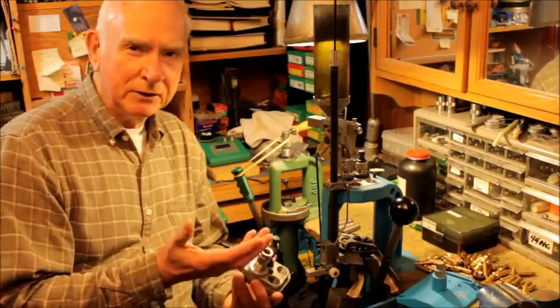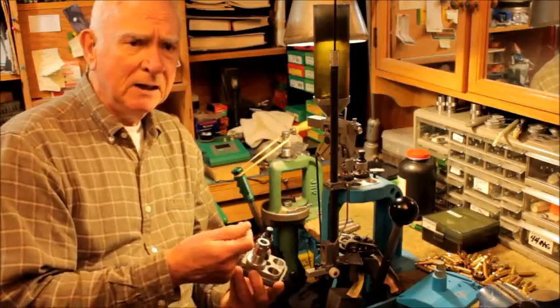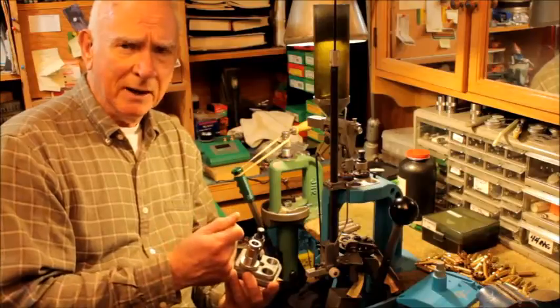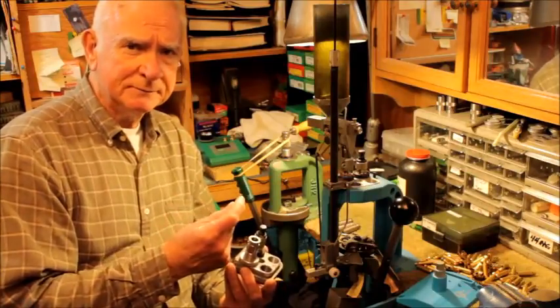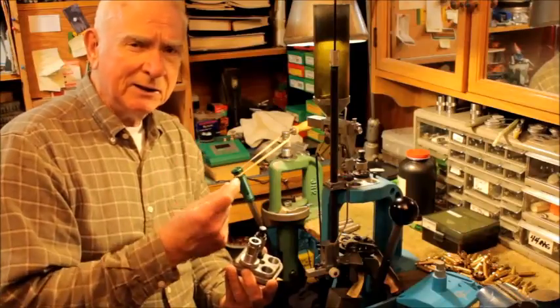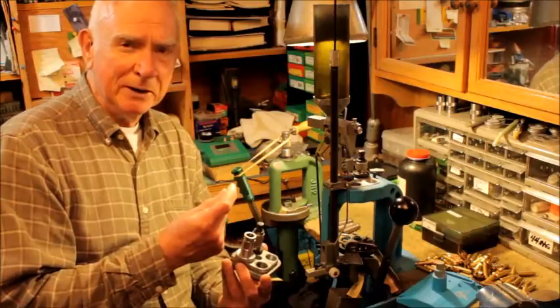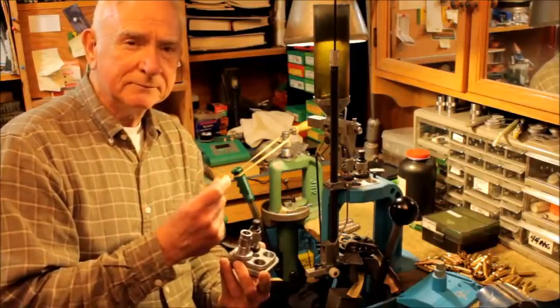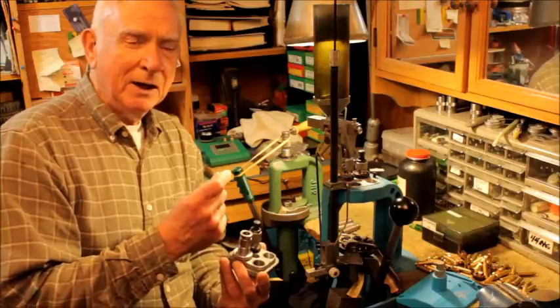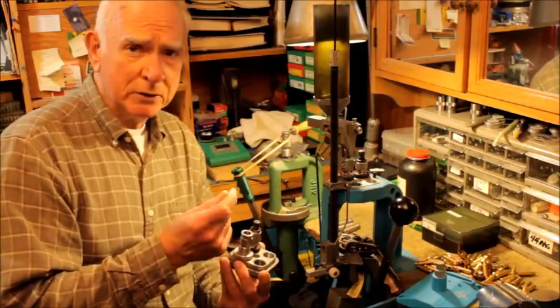The first thing I do with one of those cases, usually a 223 Remington, is small base size it. Then I will anneal, clean the cases in stainless steel media, then I'll prep. By means of prepping, I'll take the cases to the trim length, the shortest length.